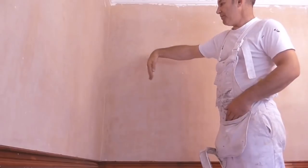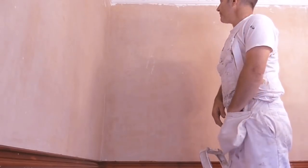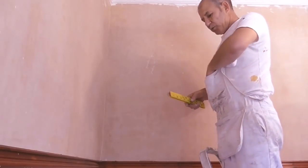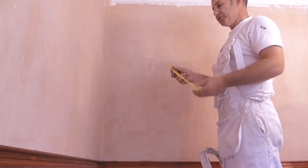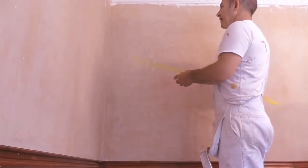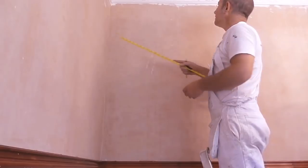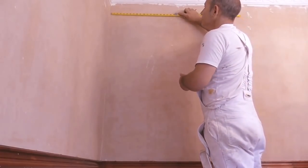This wall may be kicking out. So first of all, measuring the width of your paper, knowing how wide it is — say for instance 21 inches — then you want a slight overlap around this corner. So 21 inches, I'll mark this at 20 and a half.